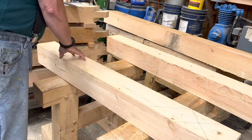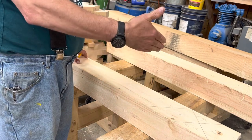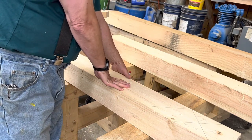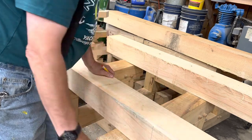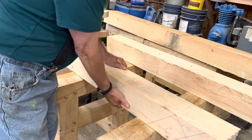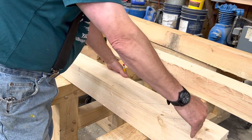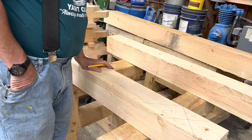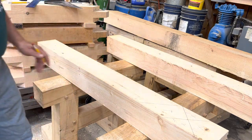I've marked this on one side. What I'll do is take the radial arm saw, do all the cuts at 45 on one side, then move and do 45 on the other. This back side of the brace is always on the fence. What we don't want to do is cut half the brace on this back side, then flip the brace over and cut the other half on this side. If we use the same backstop and rely on the angle of our radial arm saw — which is pretty precise — they're going to be exactly 45 degrees. Like and subscribe if you will. There's a video of the radial arm saw operation roughing out the braces. Thanks for watching.